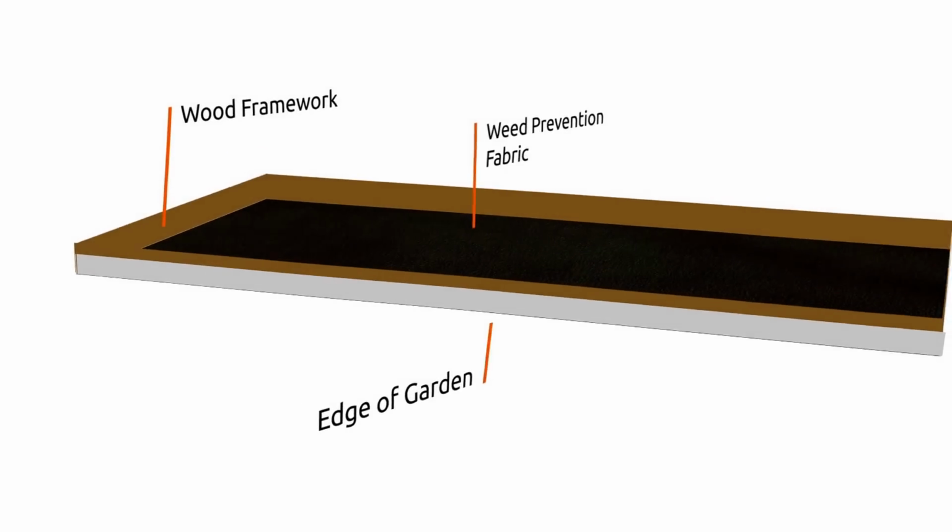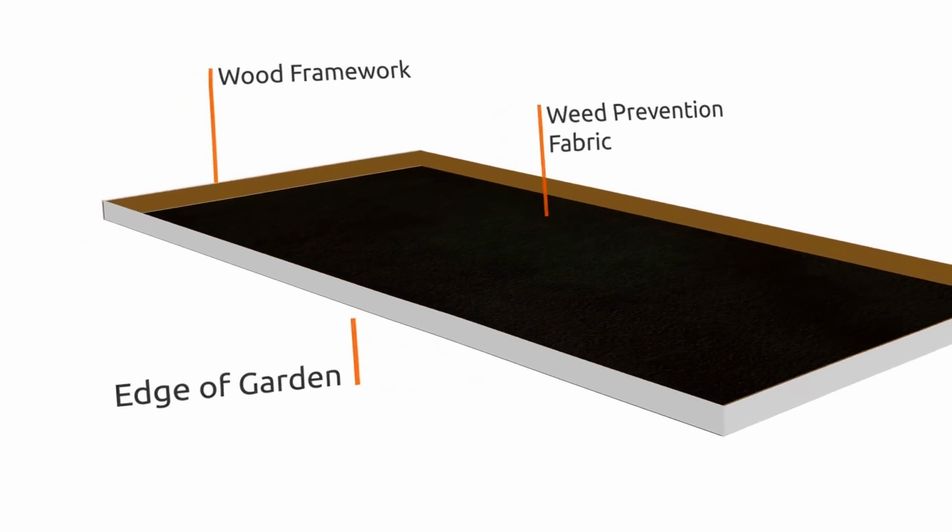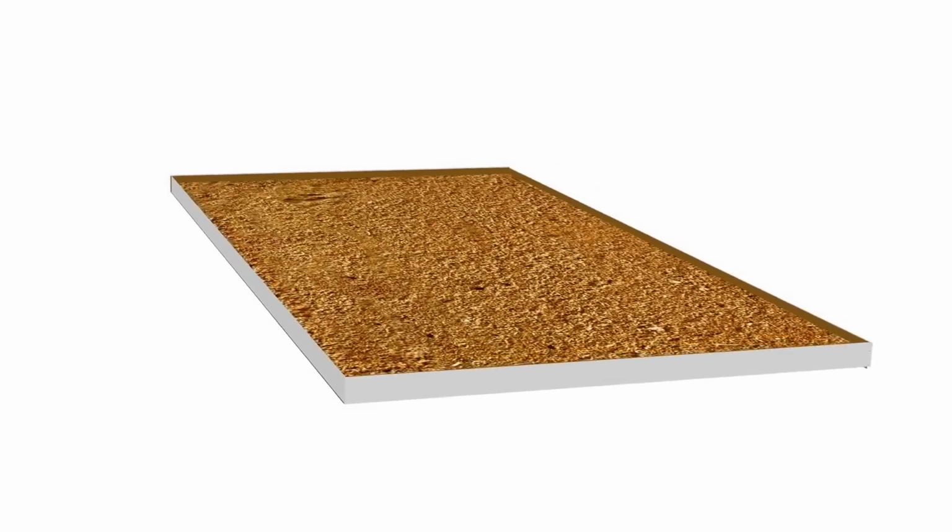As artificial grass is permeable, rainwater will run straight through it. However, during wet weather, water may stand on the soil surface or drain very slowly. To resolve this, crushed aggregate can be laid to a depth of 75mm and compacted prior to the weed membrane and sharp sand sub-base being laid. If you are not adding 75mm of aggregate, the timber framework should be submerged into the ground so that when the sand is laid and compacted, it is flush with the top of the timber framework.